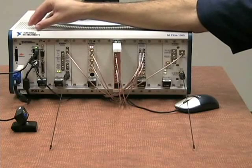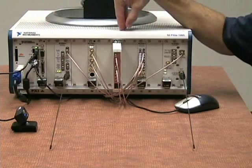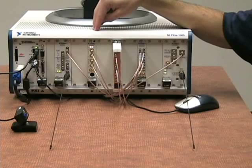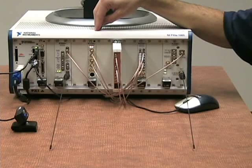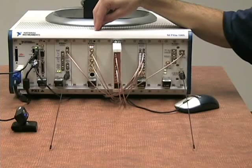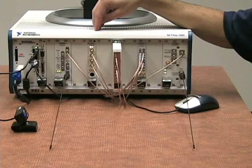We then send that data to one of two FPGA devices. The first is the PXI Express 5641R Rio IF transceiver, which is basically a LabVIEW programmable FPGA coupled to high-speed, high-resolution analog inputs and outputs, which are targeted at intermediate frequency applications.